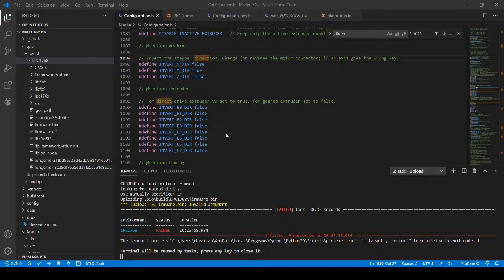Apparently, I don't see it. Well, I do see it, so I'm going to right click and send it to the drive directly. Then I'm going to go verify it's on the drive. I know you can't see this part. It says that it's there right now. So I'm going to power cycle the actual drive for the USB to the MKS SGen L and bring it back up and see if it loads. So it should come up as firmware.cur.